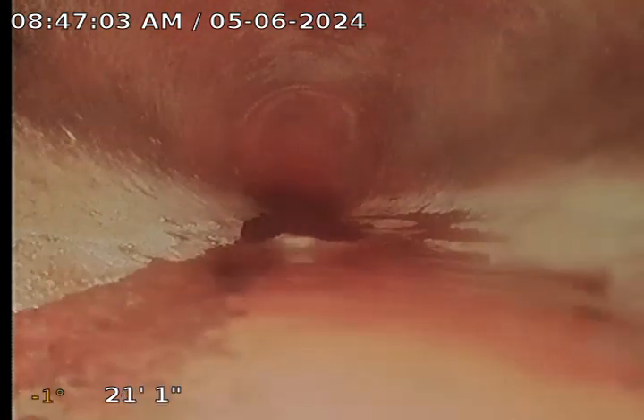Going back to the root connection — it's at 22 feet, into the clay piping. Right there is where you would need it. You have about 20 feet if you want to run a liner in that section, and that's at about $150 a foot to run an epoxy liner — that would solve the problem permanently.